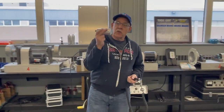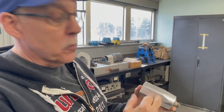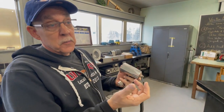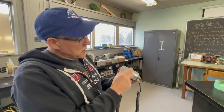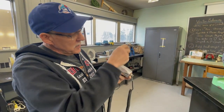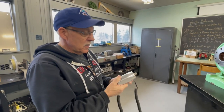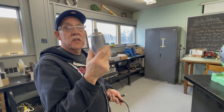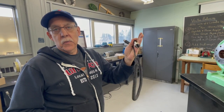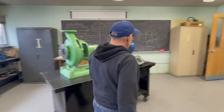The velocity transducer doesn't have a piezoelectric crystal. Instead, it has a magnet with an iron core wrapped with wire, suspended between two springs. The faster it vibrates, the more voltage it makes; the slower it vibrates, the less voltage — the box reads this and makes the waveform, then converts it via FFT. The difference is these velocity transducers are much more durable — you could get away with a lot more abuse compared to the delicate accelerometer.